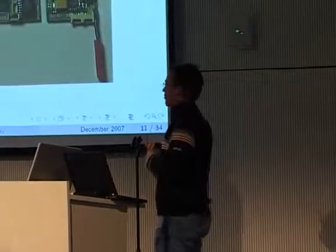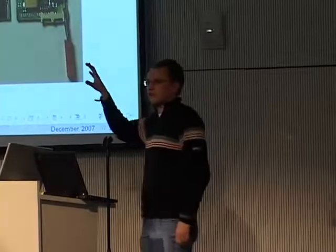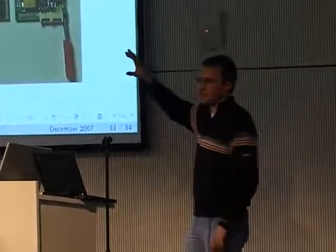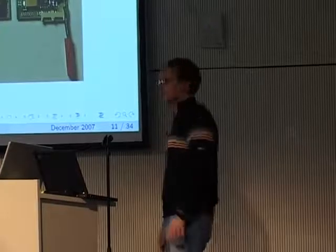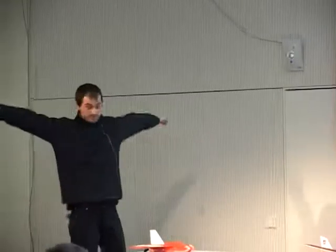And in 2004, there was new hardware developed which contained 2 AVR processors, which had a little more power than the PIC. We have 2 processors, so one processor just does the RC, and the other one does the navigation. So if you do fancy stuff in the navigation and the processor crashes, you'll still be able to fly it. You see these 2 processors, you also see a modem and a power supply. And we also shrank the size of the aircraft considerably. The first aircraft was 1.5 kilos, this one was 400 grams, and the first aircraft was 1.5 meters span, and this one is 65 centimeters.